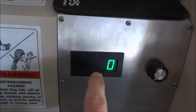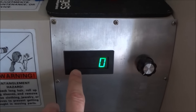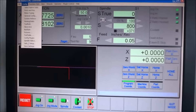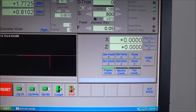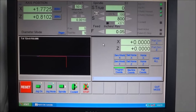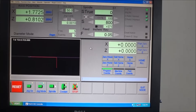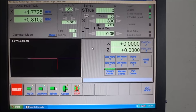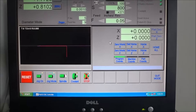I want to try out my tachometer. I'm using the sensor for the tach which is a proximity switch, to link up with Mach 3 and hopefully it's going to sync up well. I haven't seen anybody else use this setup for threading — most people use a disk with a slot in it, so we'll see how that goes.